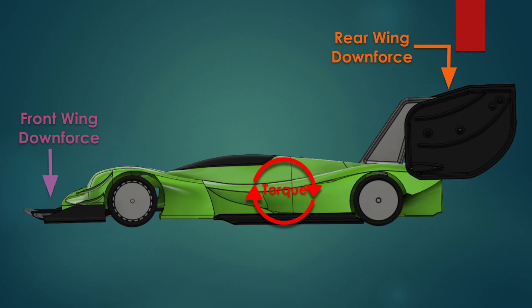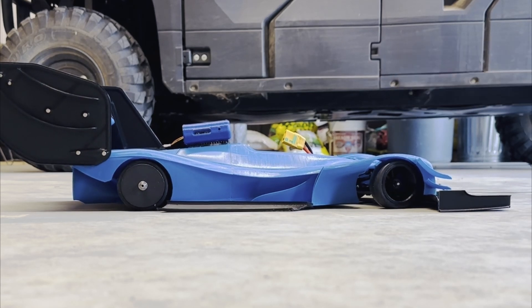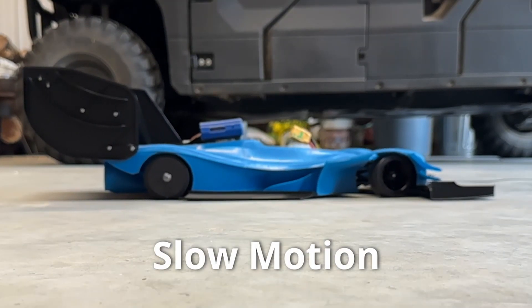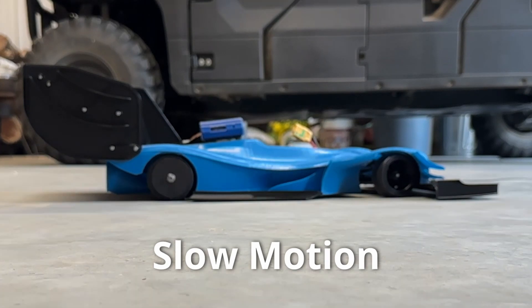In real life the car is hugely unbalanced when going over uneven ground, because we're making so much downforce at the far ends of the car — it's really creating a teeter-totter effect. The giant front wing is in ground effect and is very sensitive to bumps and pitch changes, so it tends to overwhelm the front suspension and stall when it gets too close to the ground. Because the front wing hangs out so far in front of the tires, the smallest bump at the rear drops the front wing down several millimeters, while the rear wing stays high and just keeps torquing the chassis backwards, causing the chassis to go into hysteresis — or for the F1 fans, porpoising.